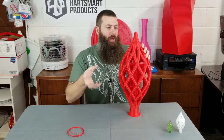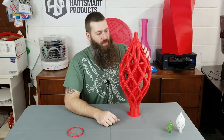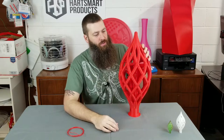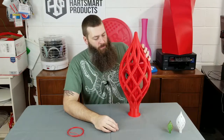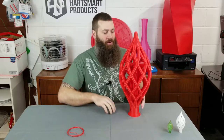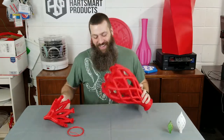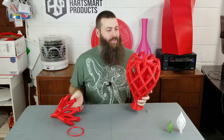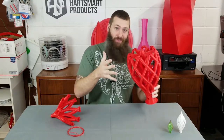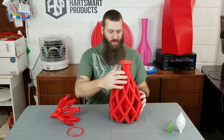I think that was because there was plastic stuck in the teeth — in the hobs on the gear — and that meant that in certain places it wasn't pushing filament even when it thought it did. So it actually under-extruded in certain places throughout the top of the print. Not only does it look bad, but it also turns out that if you've got this line all the way around your print and then your print falls over, it's not very strong. So yeah, I sort of decapitated it unintentionally. It actually fell off this table before I was filming.